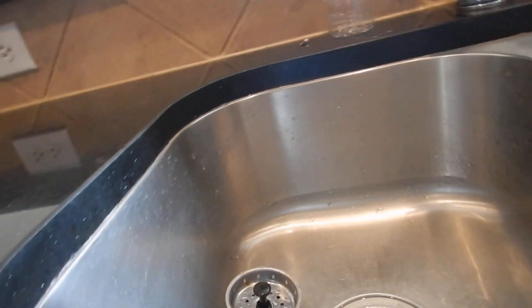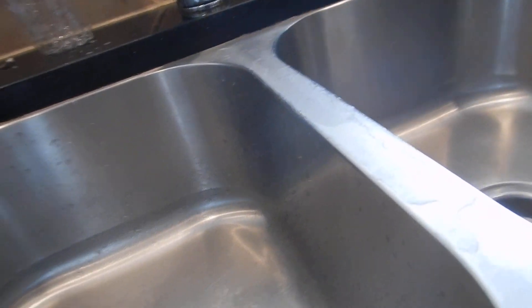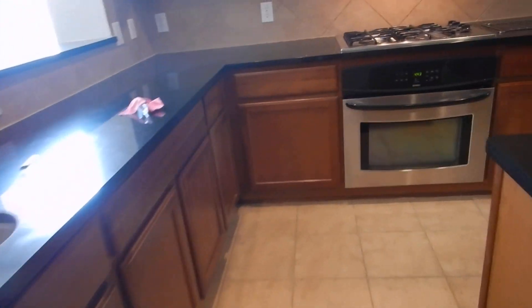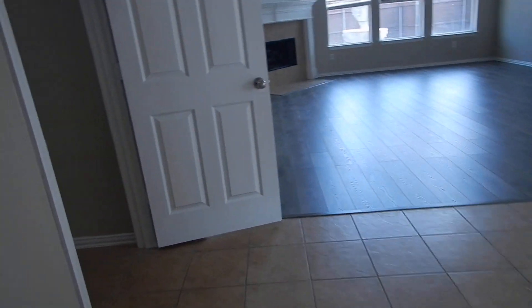This is the dishwasher - we've been running it. It looks like it's original to the house. The Texas Real Estate Commission says any rust, so we got some rust right there on both racks. Shouldn't have a rocker switch. Now, if this home was built this morning, the disposal and the dishwasher would be GFCI protected. But this house wasn't built this morning - fifteen years ago, it didn't have to be GFCI protected, just like the garage and laundry didn't have to be GFCI protected at the time.